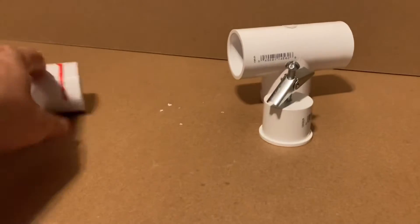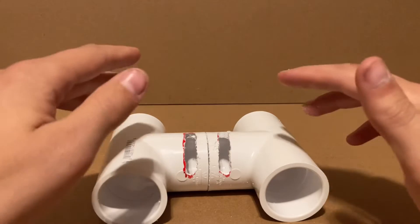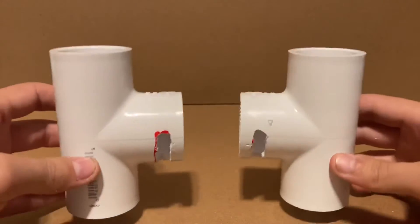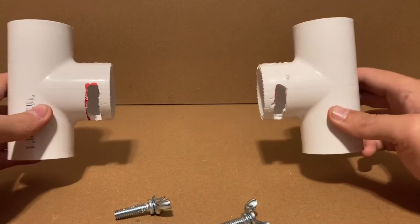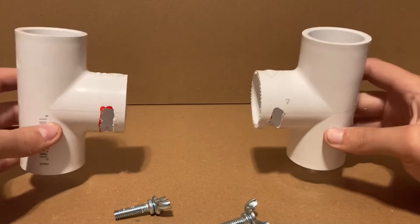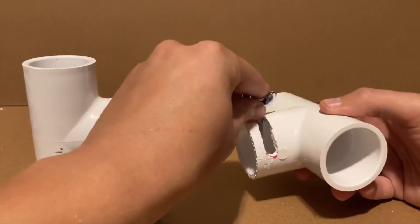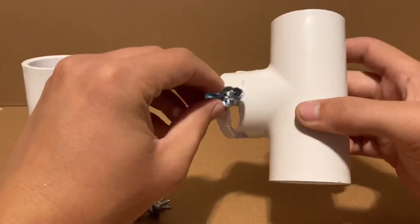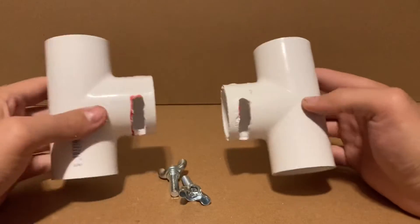Those two are punched out. Now we're going to Dremel out these lines. After that we'll move on to the couplings. You Dremel out those two parts — these are going to be for your wing screws. These are going to sit on the side of the apparatus, and your wing screws are going to let you tighten or loosen so you can adjust the height of the rods from straight up to straight horizontal or anywhere in between. Those channels have to be wide enough so that your wing screws can slide, but not so wide that the wing screw can't bite down when you tighten it.